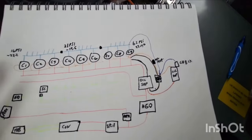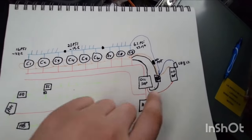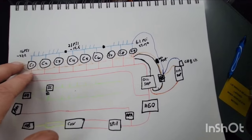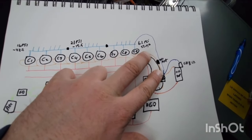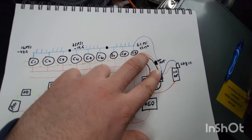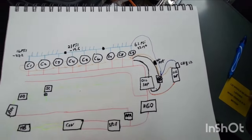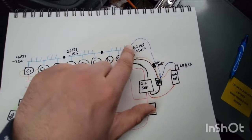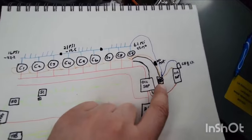Right, so another case is, let's say you come here and your oil is empty, all the compressors are empty, there's no pressure differential across your filter, and your check valve works. So you have to check, and I'll post a video of that below, but you check your check valve, it should hold about 20 psi above the highest suction group, right?